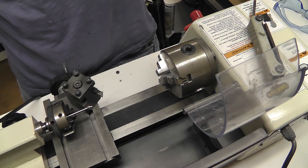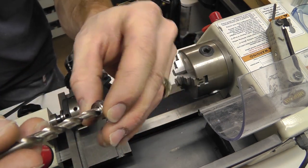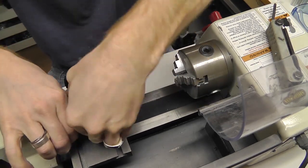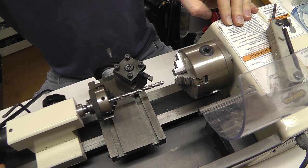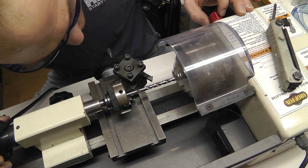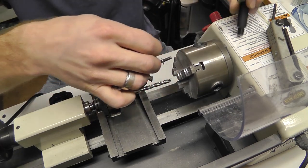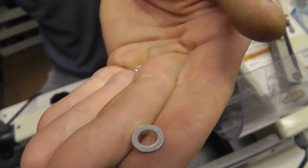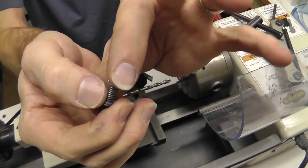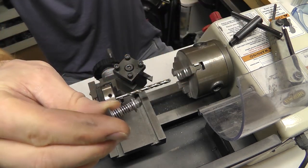Now I'm just going to take a quarter inch bit and drill it out. Changed my mind. I'm going to use a 15/64ths. It perfectly fits on here, so it should fit on there and be a little bit tighter in tolerance. That's precision. It almost doesn't fit on there, so we will clean the burrs up, and that's perfect. Do the rest of them.